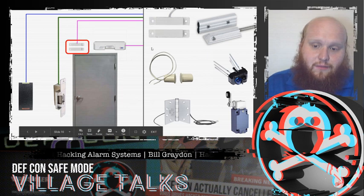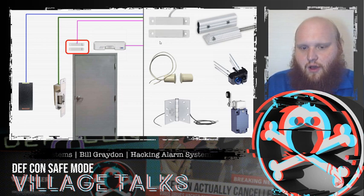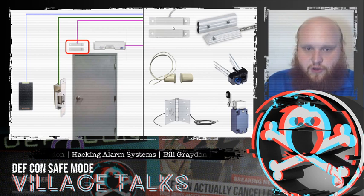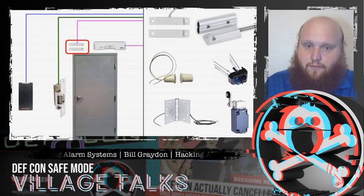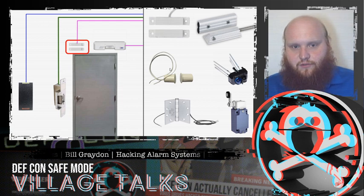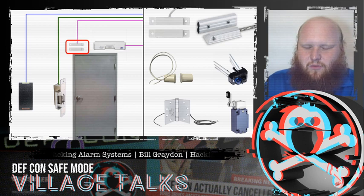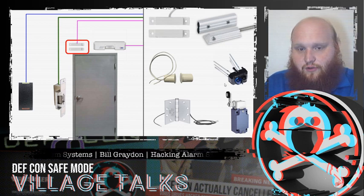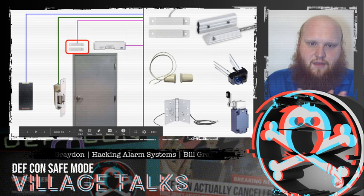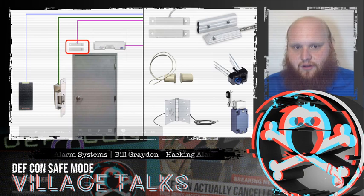In terms of the sensor, the goal is to detect whether the door is open or not. Most commonly we see magnetic base sensors mounted on the frame of the door — they should be mounted on the secure side, as mounting on the insecure side opens up a whole host of attacks. We also have magnetic sensors mounted within the frame by drilling holes in the frame and door. We can use optical based sensors detecting light or dark, some hinges capable of reporting their position, and mechanical based sensors tripped by an arm when the door is in the correct position.